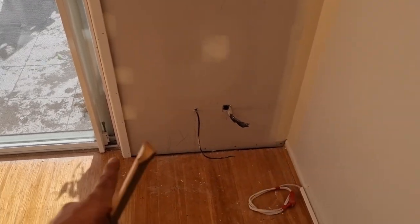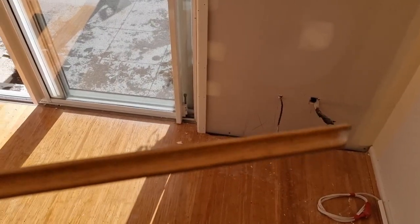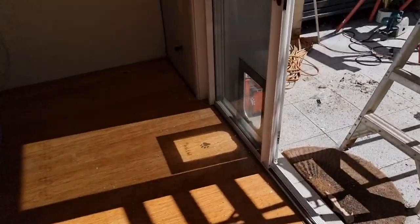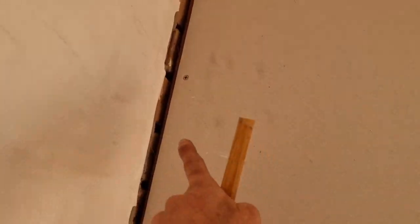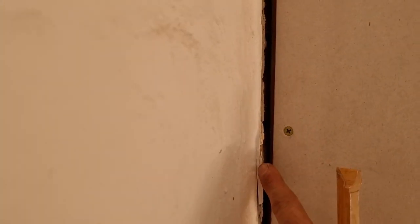Downstairs here I've just got to put that last skirting board on and reinstate these quads that were installed when the flooring was done. Same on this side. And I'm also just going to put up 66 bullnose up here and I'll scribe against that brick.